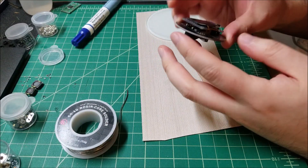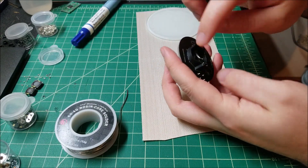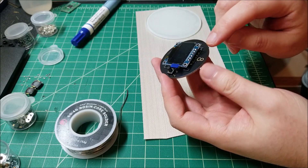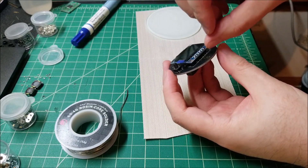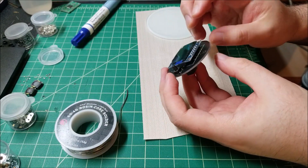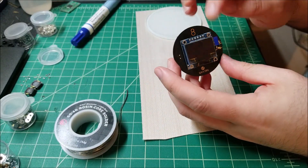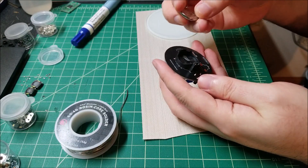I made a little oopsie while designing this — I hadn't considered that the plastic of the battery container, even though I drew the outline, would cover up the solder pads from the back. So you actually have to solder it from the front. In retrospect I probably would have just removed this header. I also had to trim the pins otherwise the screen was sticking up too far. I'll nudge the battery bay a little to give clearance for soldering, but for a prototype this will be fine — let's just see if it powers up.